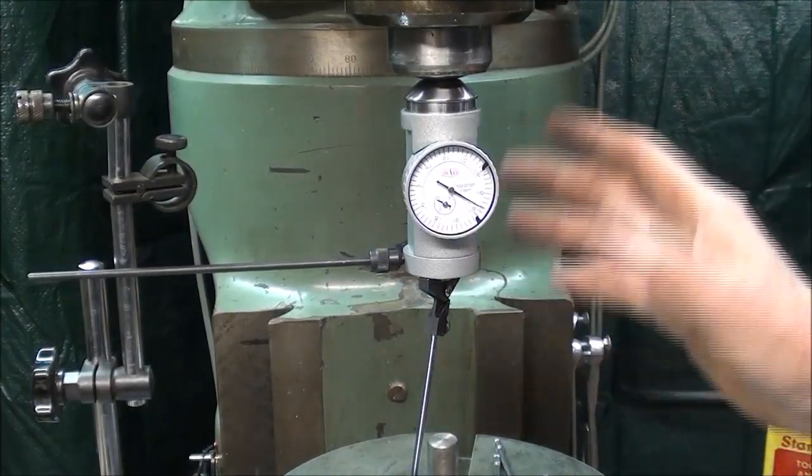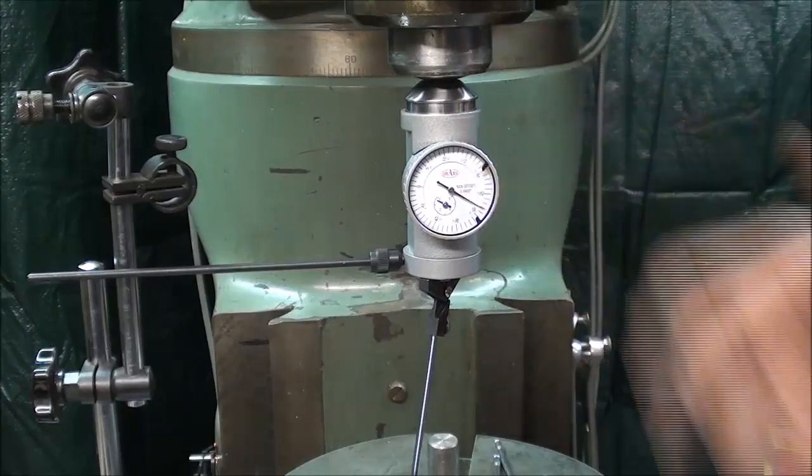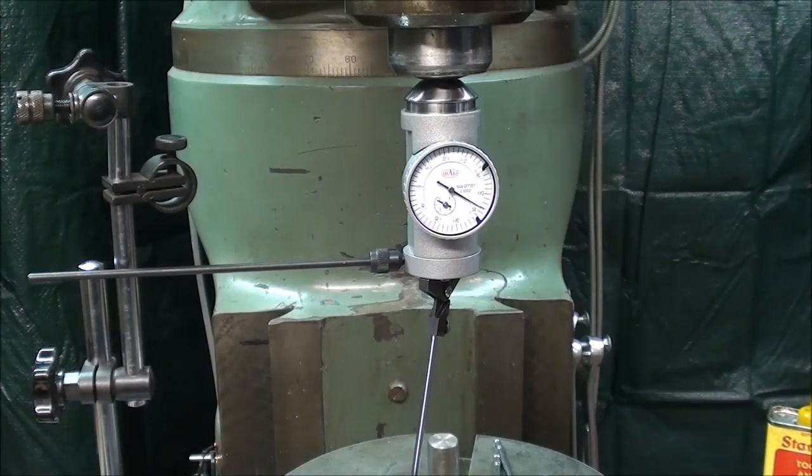The beauty of a coaxial indicator, of course, is that it always faces you, the operator. You don't have to get back there with an inspection mirror or get your head around the backside. Furthermore, you're also using this with the machine running, the spindle turning. It's important to note that this particular model has a maximum of 700 RPM. Now, do not run them faster than what your directions tell you. And I've got the machine set at 660 RPM.